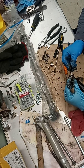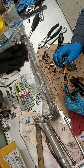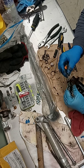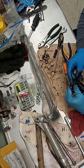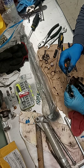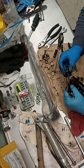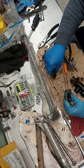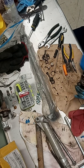And here's your rod — this bolts to the tractor's brake pedals and actuates the cylinder. Now the seal kit shows that it comes with this washer here. I have no idea how you would get that off — it doesn't look like a wear part that needs to be replaced, and this rod is one piece, so it doesn't thread together. I have no idea how they expect you to replace that, so we're probably not going to. We'll set that aside and get to the rest of it.